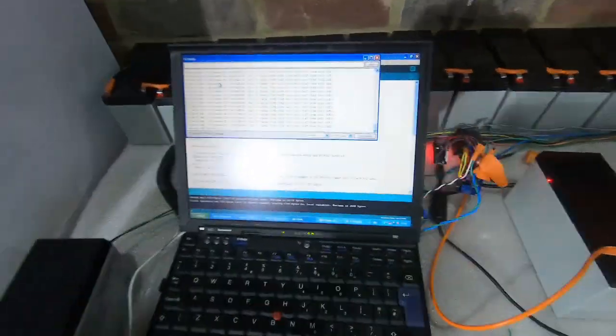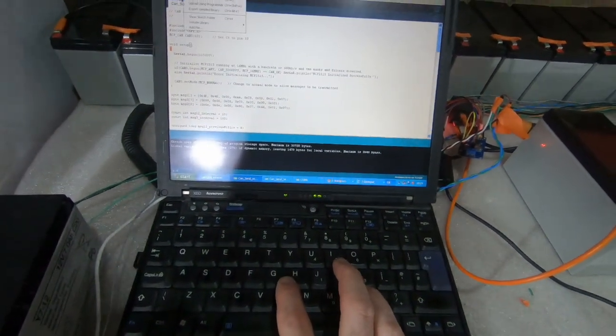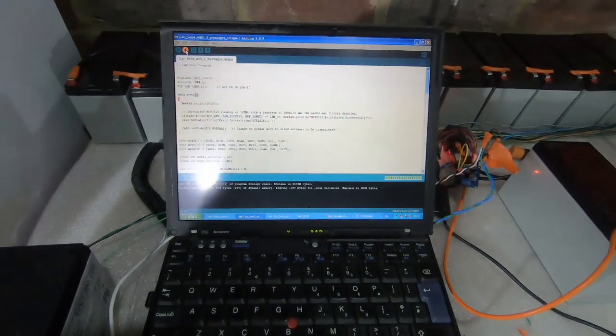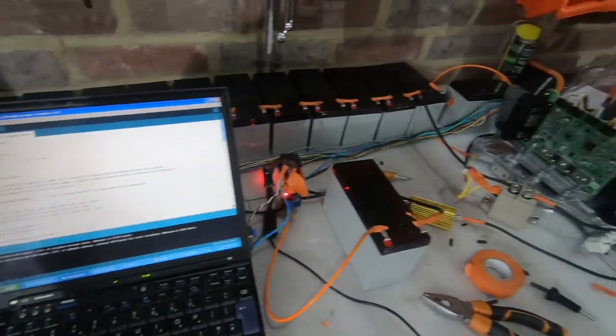And that's when, with some new software, we'll eventually be able to send a message to the inverter telling it to send power through the motor. I still have a little bit of a way to go with the software — basic though it is for controlling the inverter — just about getting the timings of some of the messages right so that the inverter doesn't freak out.